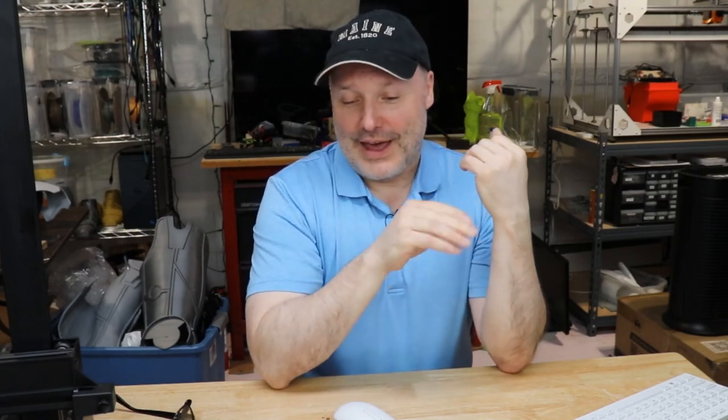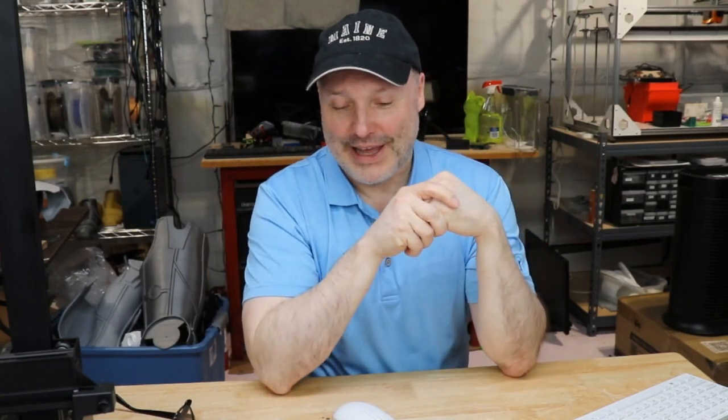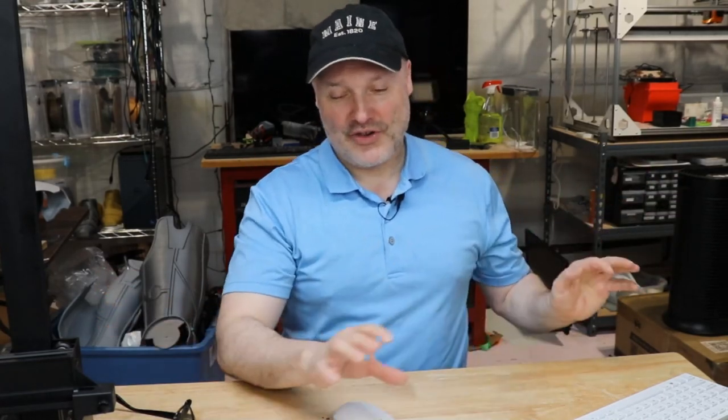The SD card didn't have the files we wanted, and their Cura slicer is not working reliably on my computers. The rub is that if I want to install the latest version of Cura, which I already have for the 22 other printers here, there is no option for the Mingda Magician Max 2. What I wound up doing was using the laptop that had a functional copy to go into the current release of Cura and create a custom printer based on the machine properties — that's how I got slicing to work. Awkward, not the worst thing in the world, but if you were a newbie and this was your first printer, missing files off the SD card and a slicer that's not working properly — that's awkward.